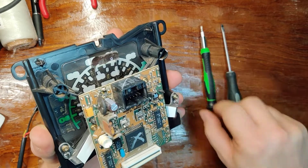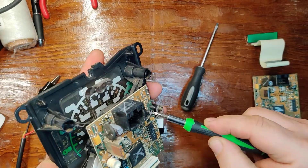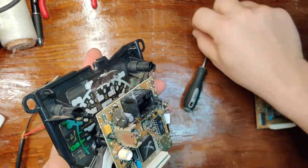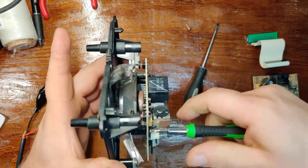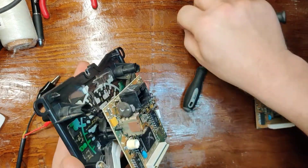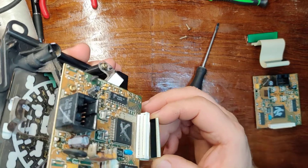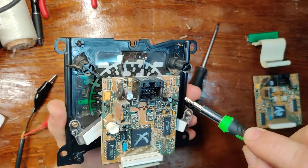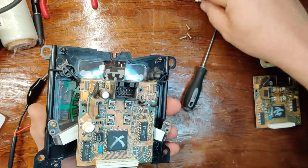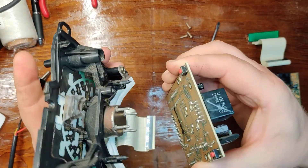You might need one of these, you might need a little T10. Let's go ahead with our little ribbon and another PCB. I like to hold it on the sides. The pin stops so the needle can be a little delicate. That slides up on the sides and that wiggles gently out. Try not to manipulate it too much. The LCDs can be a little temperamental. Once we have these three bolts out, the PCB on the side just wiggles right off. See the four pins? And that's off.